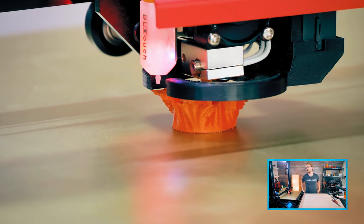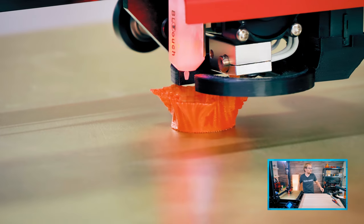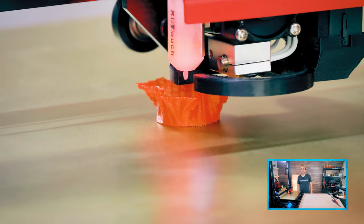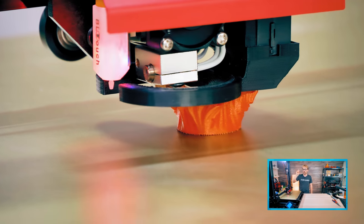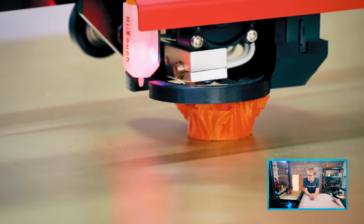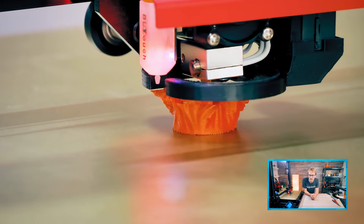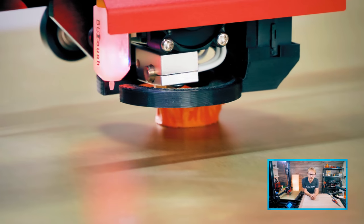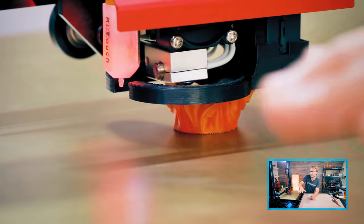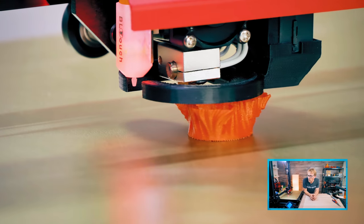So yes, it is an 8-bit board. It's a standard modern 8-bit board that it's running. It doesn't look like a standard one like the MKS or any of the other boards. It may just be a custom design. It does have the Formbot or the Vivedino font or label on there. So it seems to be a custom board, but again, there's not much to 8-bit boards. There's no smoke coming out of it yet, that's good. I just felt the SSR, the solid state relay that's controlling this massive 240 volt heated bed, and it's not getting hot, so I'm hoping that's all right.